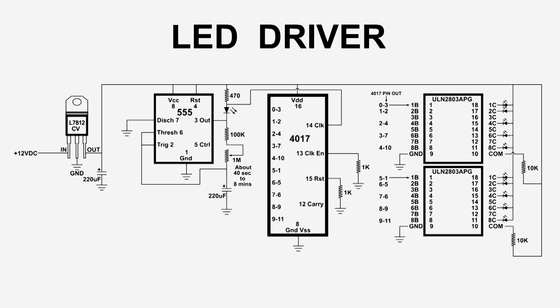The common is attached with a 10K ohm resistor to positive just to keep it from floating around. If I ground the common at the top, the first five diodes would light, and if I ground the bottom one, the next five diodes would light. The train display is going to have about two LEDs on each output, so we'll end up with eventually 40 diodes lighting up the display. We're not there yet — I gave them about 20, maybe a little more or less. I've been so busy making sure the circuit works, I've lost count of the diodes.